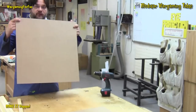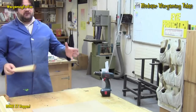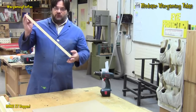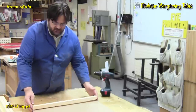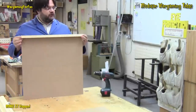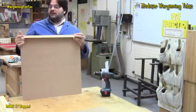Once you have four of those - you could do eight, there's no reason why you can't take the principles of this board further - I've then got these pine blocks to reinforce it. These are 2cm by 3cm and also 2ft long, just under 2ft, because of the width of the blade when you cut an 8x4 sheet in half.